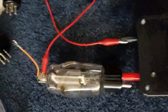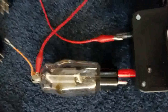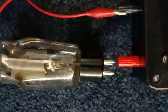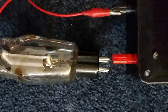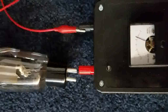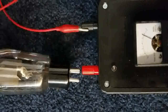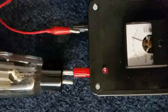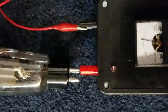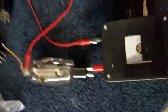This is a little bit of a leaky tube. This tube will probably run alright — it'll handle five thousand volts — but some of them will high-pot up to several thousand volts, like eight kV or ten kV, if it's a real good tube. I slid the pin out a little bit. I had to turn this off — I didn't want to grab it while it was hot. I'm going to run the voltage up again. You can see how the LED lights. This thing works good for checking all kinds of stuff at high voltage.